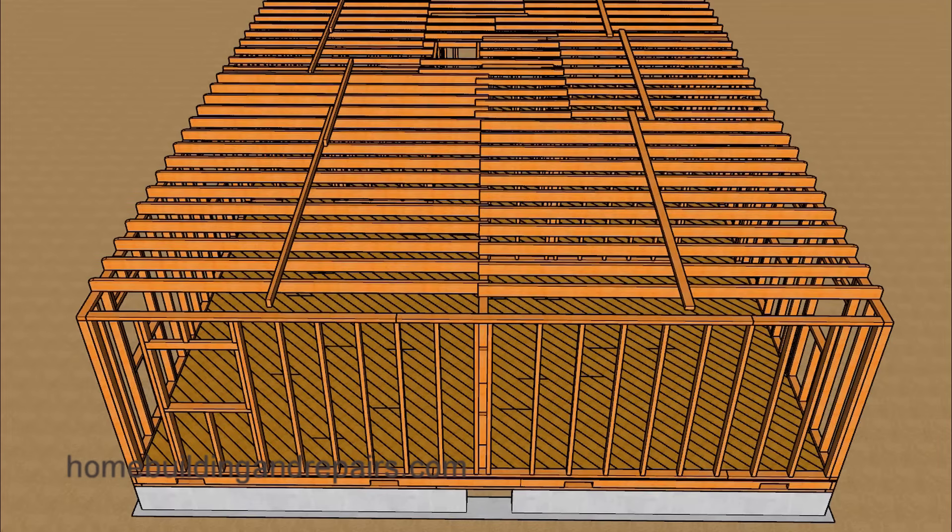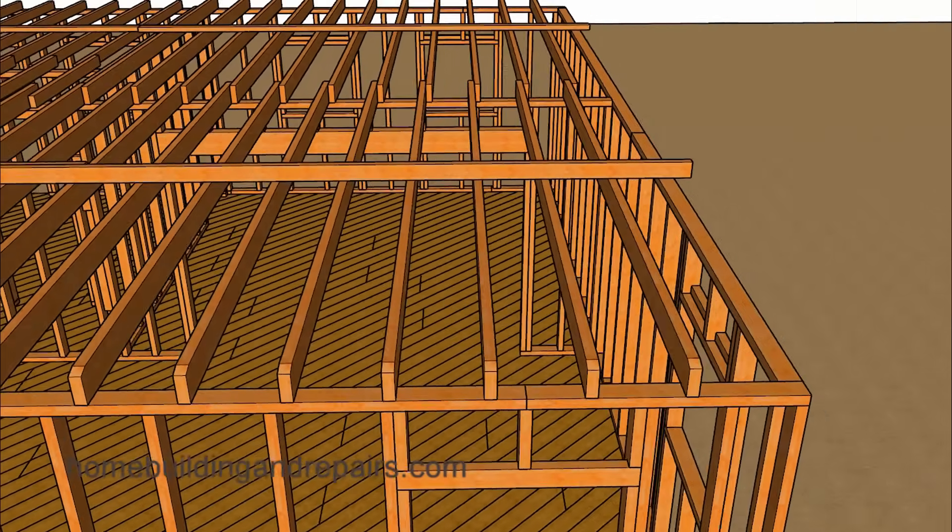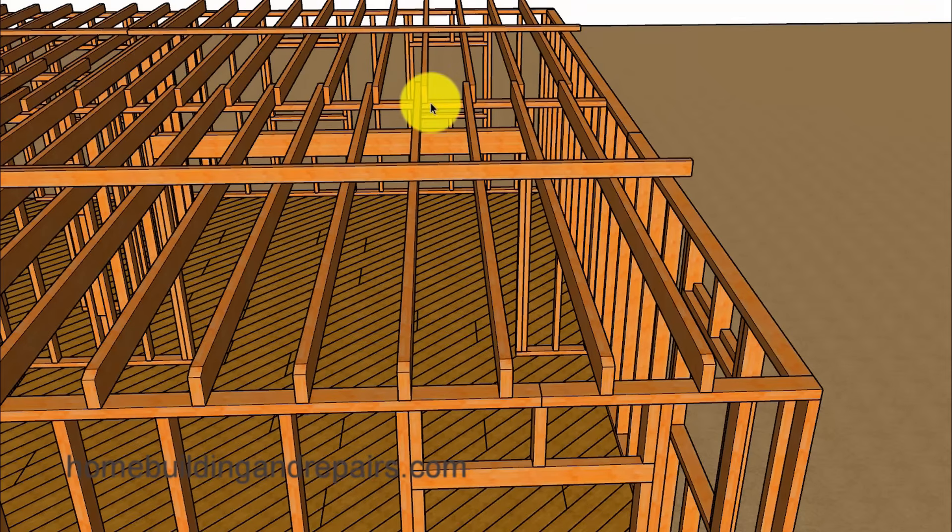My first suggestion would be to install larger joists. This can usually be done by removing one at a time and replacing it, because the last thing you want to do is remove all of the joists and have your building fall down. For the span here — a little over 13 feet — if we use two-by-six spaced 12 inches on center we'll be okay; otherwise we need to go to two-by-eight at 16 inches on center. You'll need to find ceiling joist span charts online or in the building code books, and also check out engineered products like the I-joist or truss joist.